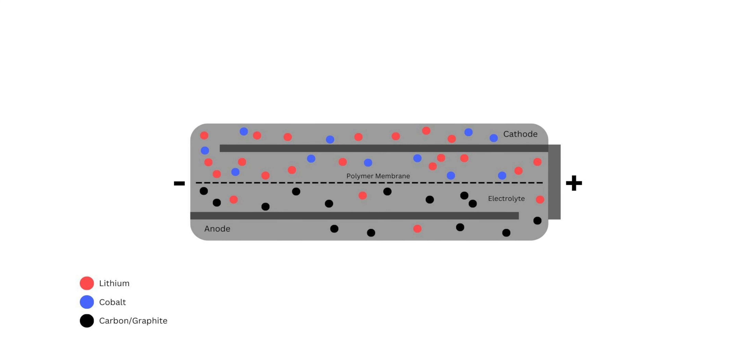Let's talk about that battery chemistry. There are different lithium-ion chemistries, and this uses lithium iron phosphate. The advantages over cobalt or nickel-based lithium batteries include lower cost, since iron and phosphates are more abundant in the earth. It also has much better aging characteristics — you can charge and drain it more times than cobalt or nickel-based lithium batteries and still maintain capacity, which is a huge advantage for longevity.